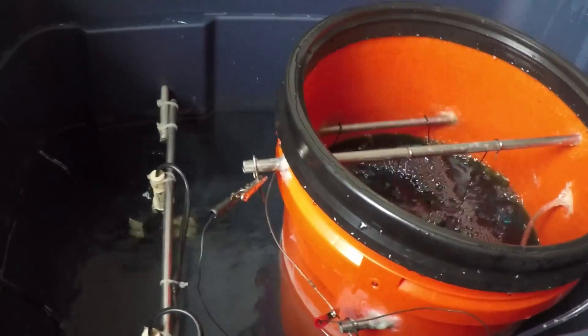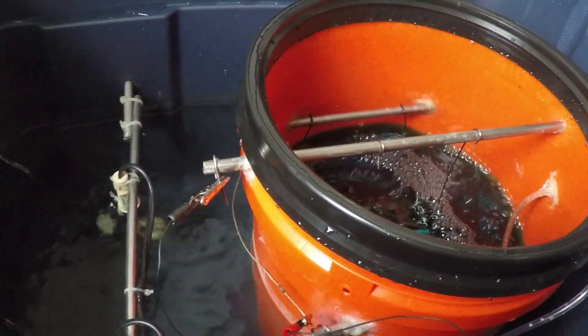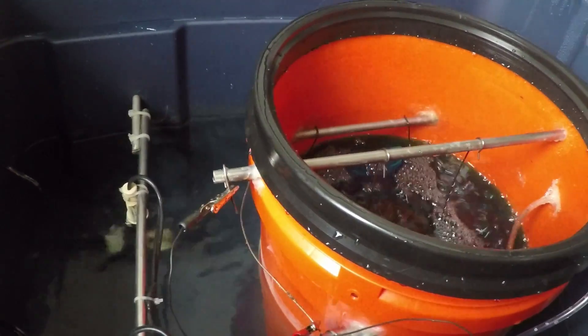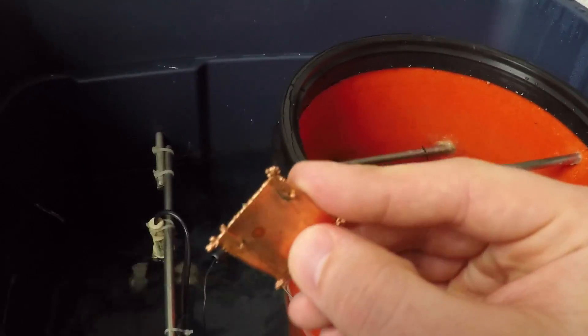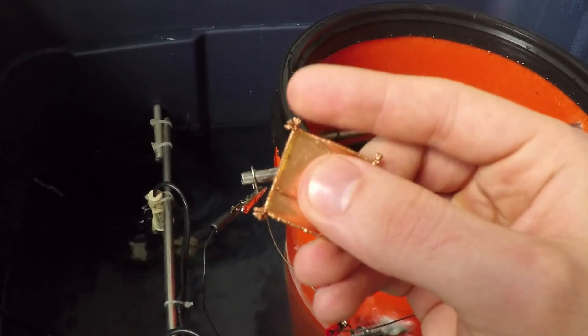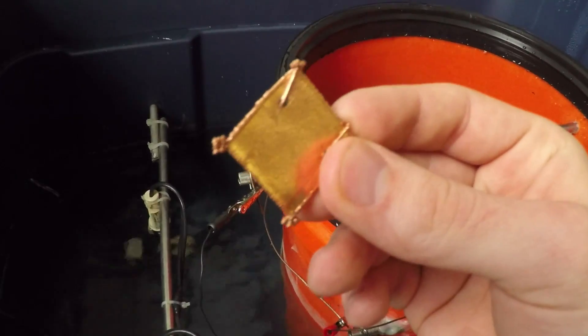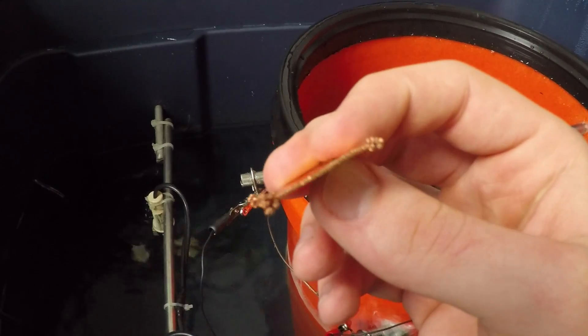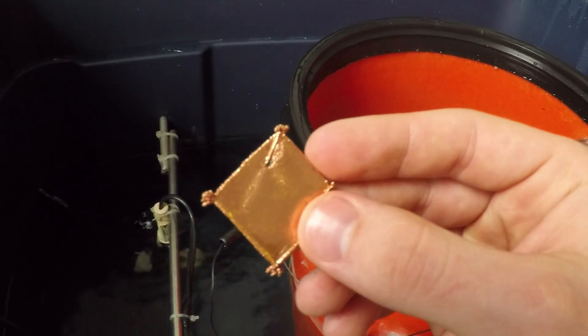That's basically it — I've gotten really good results using this plating bath. I've had it for a solid year and it's been a workhorse. Some of the stuff I've done: this was actually a prior iteration using an electrolyte with citric acid instead of sulfuric acid, which caused little tree-like elements to form on the corners. This particular piece is a sheet of paper that I painted with conductive paint, then plated in the bath for a few hours to put a nice layer of copper all over the surface.